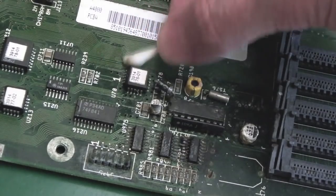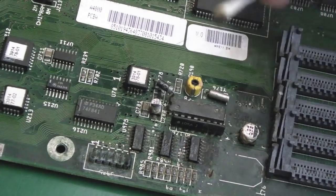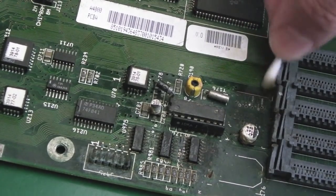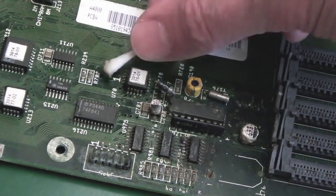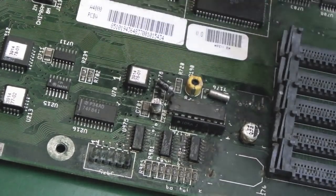You get a lot of corrosion around the SIM slots, that could be a pain, but it's one of the things that's easier to resolve. Yeah, you might have lots of fixed wires and things around the SIMs, and it could be painful removing them and replacing all the SIM slots. We might have to do that on these yet.